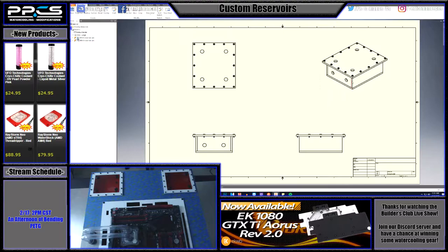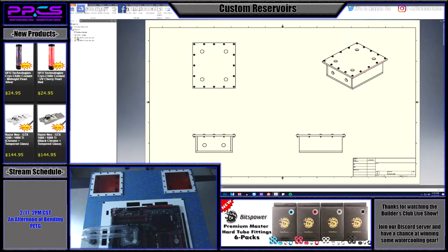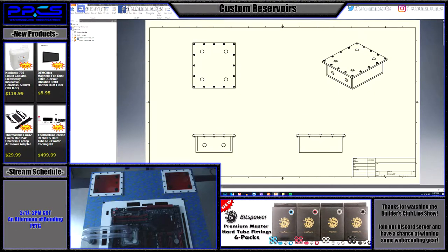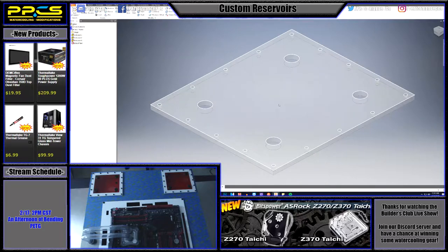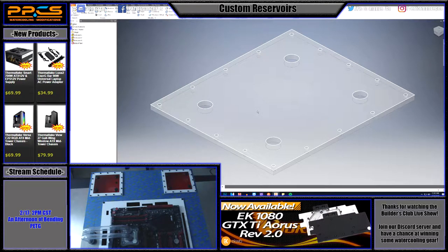For this reservoir, it's about 150 by 130 millimeters, and the top is 10 millimeters bigger on each side to accommodate the M3 screws to bolt it to a case panel or surface. I also have some 11.8 millimeter holes cut out around it — done on a laser — for tapping to G1/4 so we can have ports for the coolant to get in and out. Once you get the general idea of what you want to make, all you need is the height and width dimensions of each piece. All in all this was about 20 bucks total for the different pieces — six pieces, essentially a cube. Just let us know the design and we can get you an estimate and time frame.